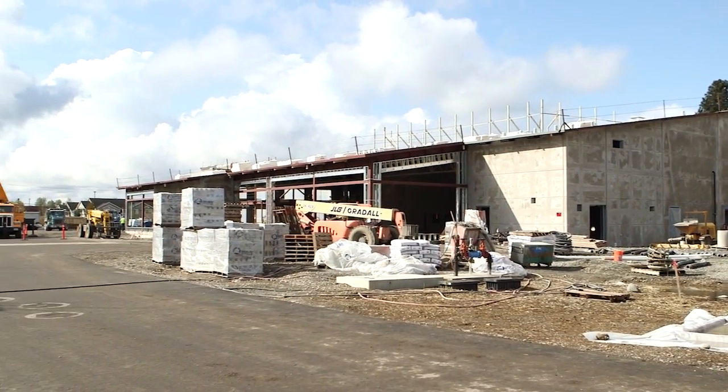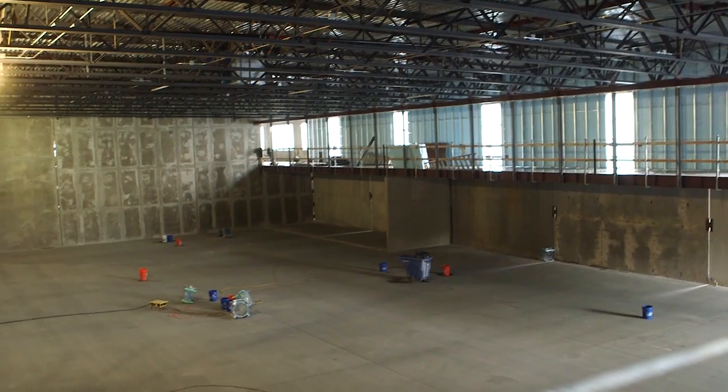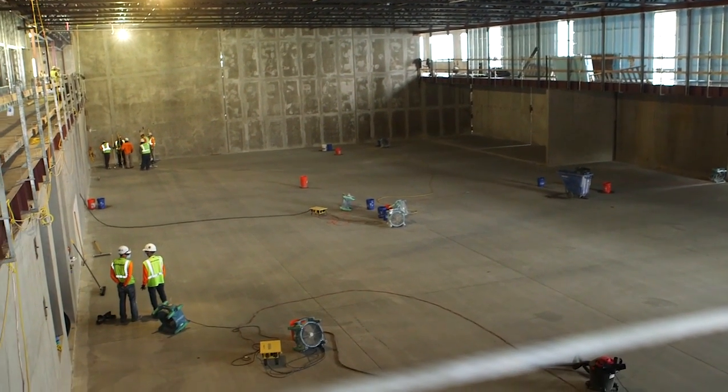In this part of the Pacific Northwest it rains a lot and it does create a high water table based on your soil conditions. So anytime you dig a hole more than about three feet deep, it's going to fill with water. It's a constant battle to maintain a dry job site. In this case we have a gymnasium that dropped over three inches in locations.